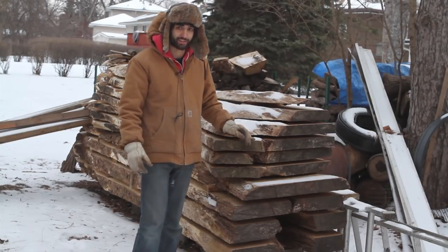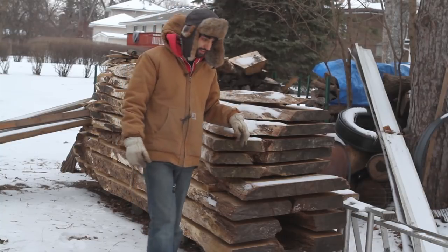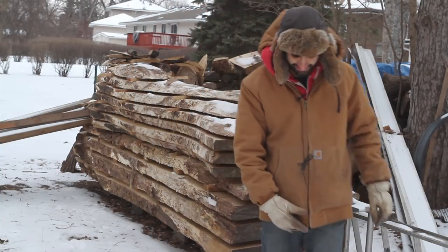Let's go back inside because it's literally two degrees out today. A general rule of thumb for air drying lumber is one year per inch of thickness, and in the worst case that's true, but typically it's not. For me in my basement, it's three to four months per inch, which is extremely fast. Outdoors it's probably more like nine months.